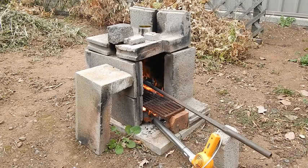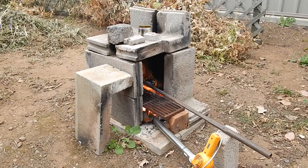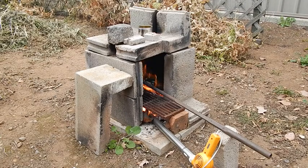You can see I've got the tin can on top of the furnace where the hot air comes out, to pre-warm it before I pour the aluminum. Just leave it there, and when we pour the aluminum it won't be going into a cold surface, so it won't put a skin on the outside edge quite so readily.